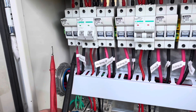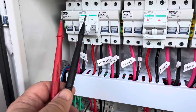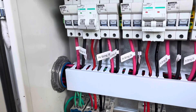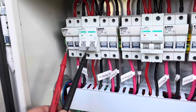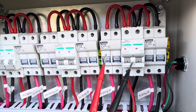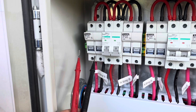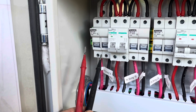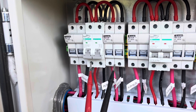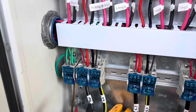Just as I thought - because this has happened before - this breaker is off. This is a 40-amp breaker and it's the breaker that sends source circuit one back to my inverters. Even if these wires are shorted together it should never see 40 amps, so I wasn't using it as a breaker, I was using it as a disconnect. Source circuits two and three are on and they're identical circuits - seven 445-watt panels on each string, they combine through these fuses and go out to my inverters.